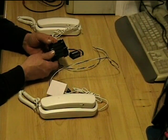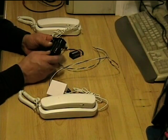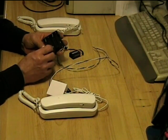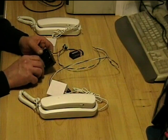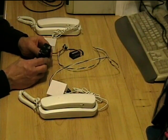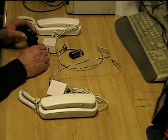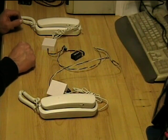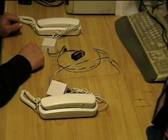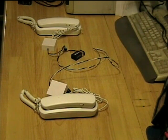A holder with eight double-A cells would be initially 12 volts — about right for trying to do a mile-long line — and the capacity of double-A cells would be about four times that of a nine volt battery, so it'd actually be a little cheaper in the long run. If you're really going to use this thing heavily, I'd go to D cells or lantern batteries — D cells have 25 times the capacity of the cells used in a nine volt battery. But if it's just light duty — like calling down to the workshop four times a day — you'll get about a year out of the batteries at each end before needing to replace them.